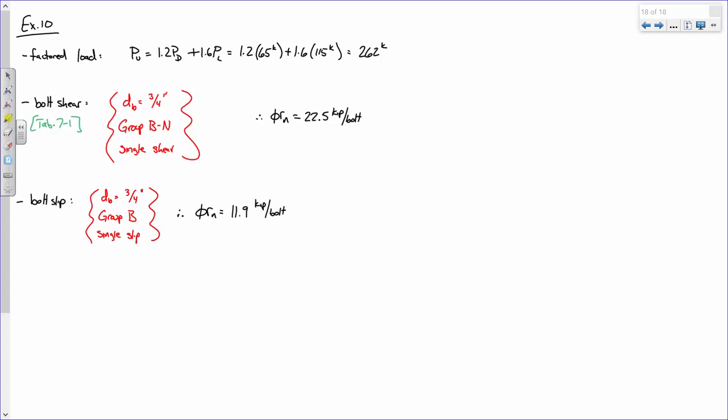For our purposes in here, yeah, but that doesn't mean you're always going to use a standard hole in practice. For instance, on expansion joints on bridges, you're going to have some sort of slotted hole to allow the bearing to move a bit. So that's a very common instance of a slotted hole. That's a great question. Any other questions?